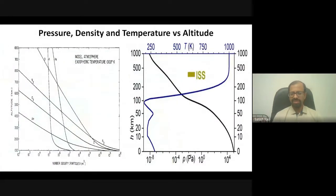Every parameter of interest to our satellite varies with altitude — temperature, density, and pressure. Looking at particle image data, hydrogen, helium, and oxygen have the highest particle counts by altitude. Even beyond lower Earth orbit, beyond 1,000 kilometers, these particles remain. Atomic oxygen is a particular problem because its presence even at higher altitudes requires us to avoid oxidation.